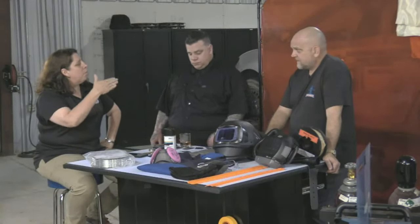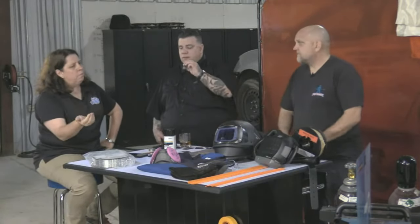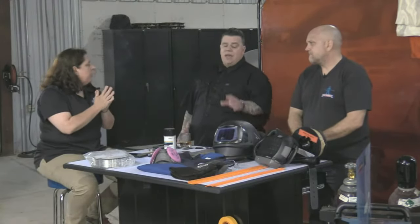It's more prevalent. We're seeing more fires kicking up right now, just because the vehicle design has changed. There are the foams, and the cavities are smaller. And you have to disconnect the battery, guys, because you're going to cause a short to ground.